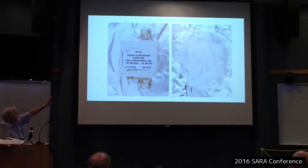Okay, here's the LNA and it has been primed. And I took care to be sure I covered all the screws and where the plate attached and everything. Any little crevice or screw was covered, so that there'd be no leaks there. But I left the label uncovered for a while because I wanted to make sure I remembered where in and out was. You know, it's pretty important. Anyway, so there it is primed, and there it is encapsulated. It doesn't look like anything.